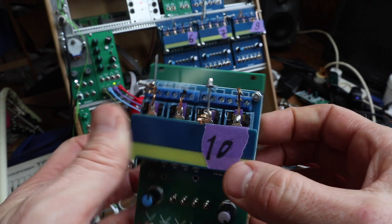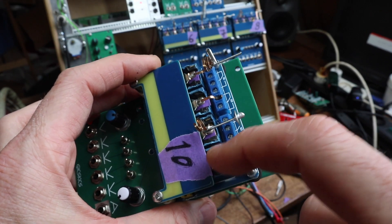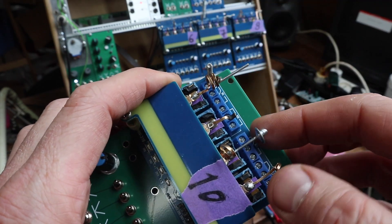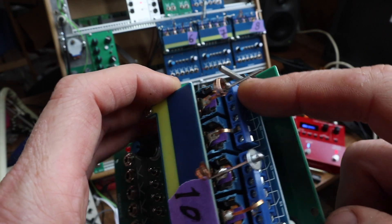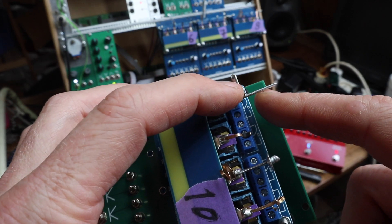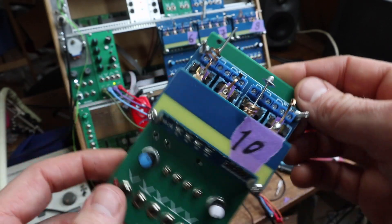There are more possibilities. You have this connector on the relay, but the switches don't work anymore because the paper blocks the switch from happening. You can still connect a spring here, make it go up and hit the spring. Also, because the metal conducts to one of the pins, when it hits something it can still switch something — you can connect some metal here, make it hit the metal, and still use it as a switch to control something external like a motor.